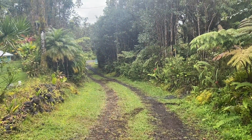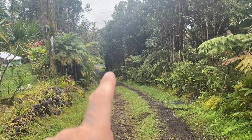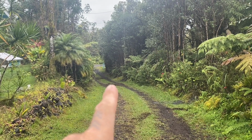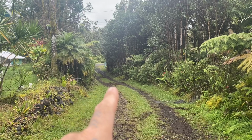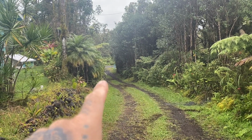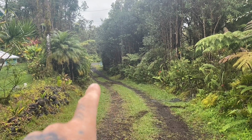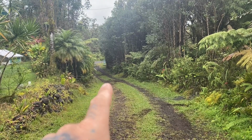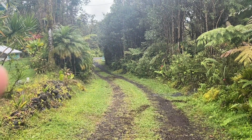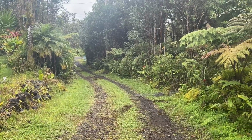The one for the gate's going to be a little bit more involved because I'm going to have to build a form. There's going to be a large kind of slab that's going to be poured around that one. And then I also need to dig a channel because I'm going to run a piece of conduit under the driveway between the 2 posts. So eventually when I have a gate opener there, I can run the wire underneath and not have to worry about doing that later.